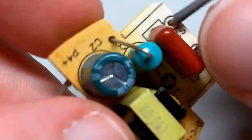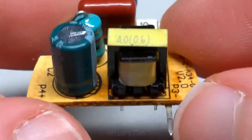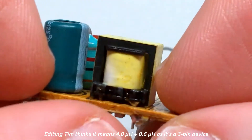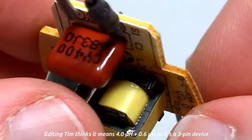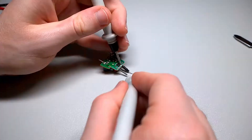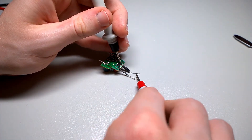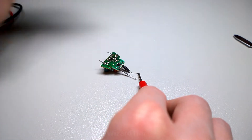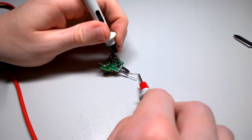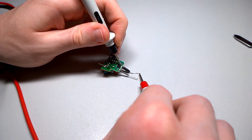This inductor is marked 4.0 (0.6), so I imagine that's probably 4 microhenries at 600 milliamps. That seems a bit much, but it's probably correct. So I think the very first thing to do will be to test this fusible resistor, just to make sure it has continuity. Testing it — yes, it has continuity, it's a couple of ohms. So I'd say this is good, and that means nothing has catastrophically failed short circuit.